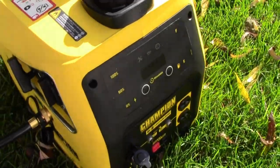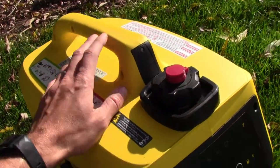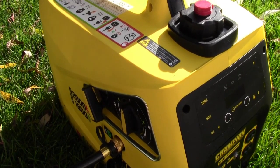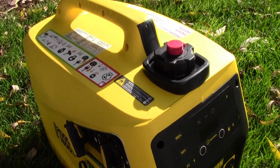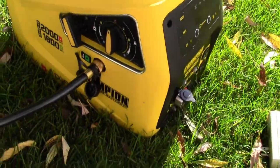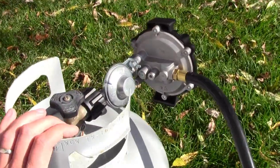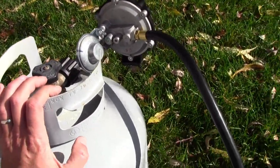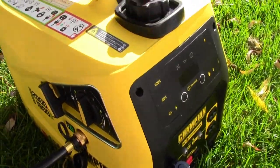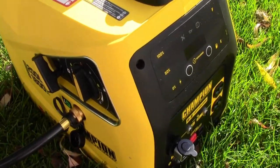What I found doing a lot in the woods is the generator gets strapped down with tie-down straps and bounces around a lot. Sometimes I don't know what happens with the carburetor — too much fuel gets in there or something and it ends up flooding itself out. It's a huge pain. So with this, it comes with an easy-to-put-on regulator — hook it up to a little 20 pound tank and I'm set, never have to worry about that issue. Plus with propane, when I'm storing this thing since I really don't use it that often, I don't have to worry about gas spoiling. So that's a huge benefit for me.